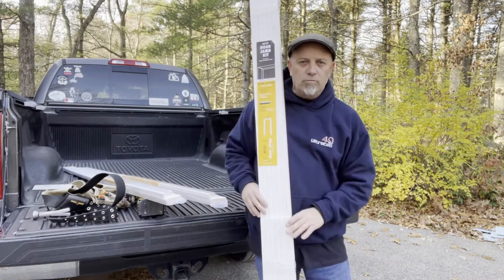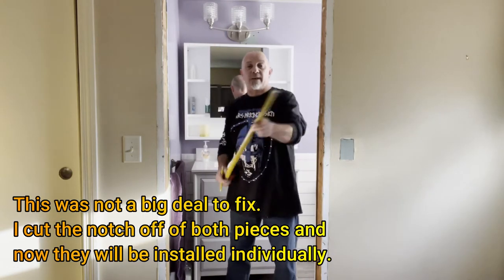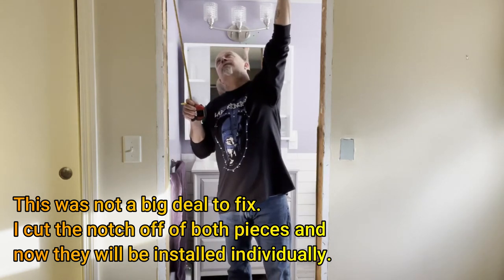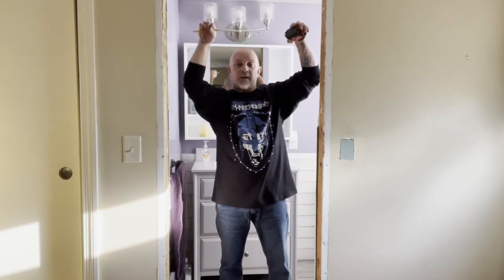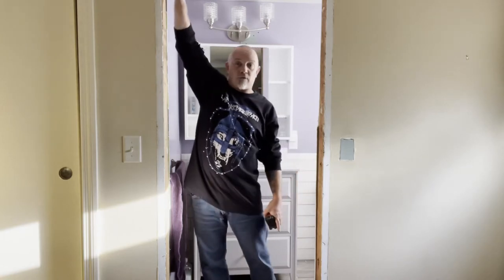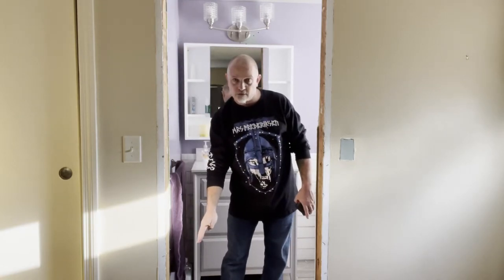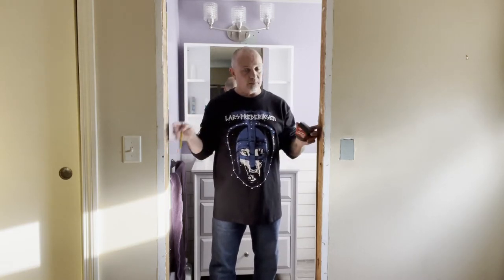These are going to sit on the flat — one on the top — and then the casing will wrap around both sides and make it look beautiful. The first thing I'd recommend is getting this top piece right here. Take a measurement — 28 and 7/8ths — check the other side, and then put a level on it. If one side's higher than the other, stick a couple shims in before you nail it to make it perfectly flat, so you're not looking at it crooked. Get the top level, then take a measurement from touching that trim down to the floor or the threshold, whichever hits first, on both sides — because it may be off a little. You don't know about your floor and you don't know about your header. So: header first, level it, shim it if needed, nail it, and measure both sides. Cut them individually — don't cut them the same unless they are the same, but measure first, then cut.